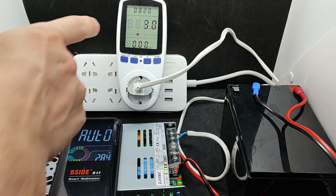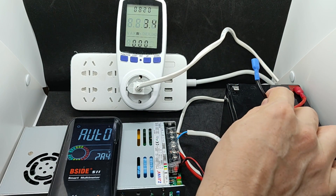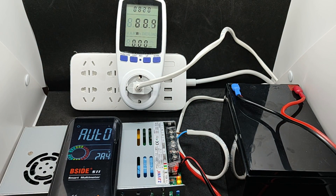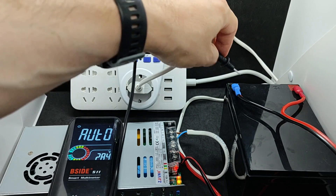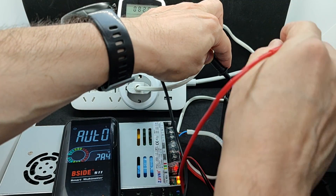With the battery still not connected, the power consumption of the unit is 3 watts. When I connect the battery, the consumption increases to 60 watts — the battery is about 20–25% charged. It then drops slightly but remains around 4 amps for the battery. During the tests, the maximum I observed was over 70 watts going to the battery, which aligns with the specified parameters. You can find the review of this battery in the description as well.